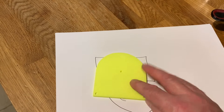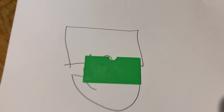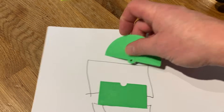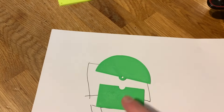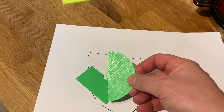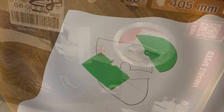From that I designed this template. Our bottom section, our bottom plate, is here, and our top plate is there. In reality the plate would be a lot bigger, but this is a demonstration. We're going to cut about 20 or so top plates out of aluminium and the same number of bottom plates. They stack side by side on a threaded bar, rotate into the bottom plate — the more you mesh, the higher the capacitance and the lower the frequency.